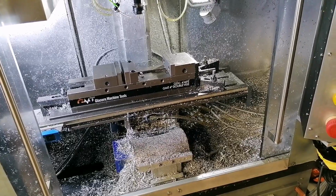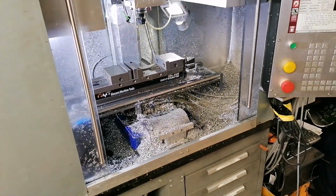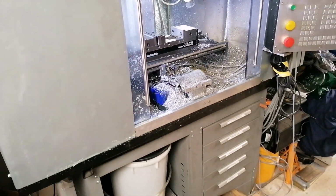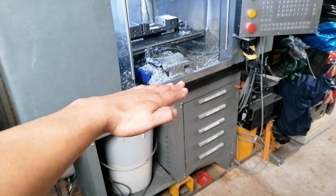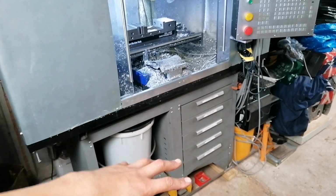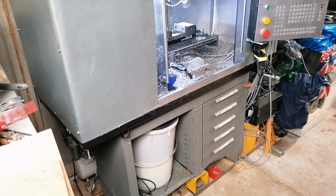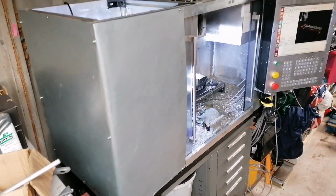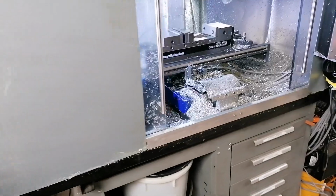So I'm building something that's similar to the Haas machines, or that kind of level. So I'm starting with big bits of cast iron and building up that way. Instead of this being a mill that's quite high off the floor, where you get a lot of vibrations, my new mill I'm building off the floor as a big piece of cast iron, and I'm going to build chip systems and that around it. So that's just a quick update on my mill and where we're at.